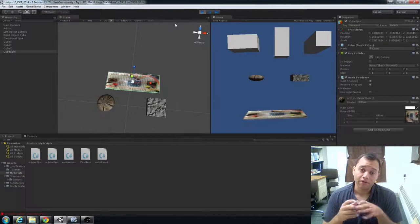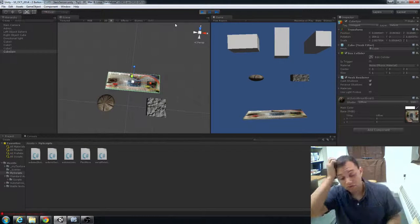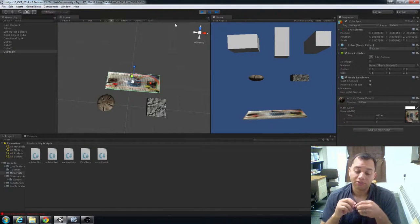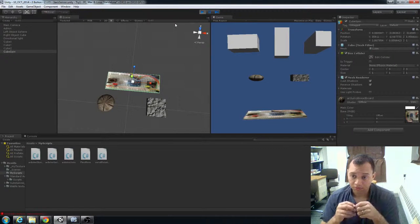and that's something I can measure fairly easily. The only issue with the potentiometer is it has a little bit of actual physical resistance, so you feel it on the glove, but maybe as you use it more that will wear down. And two, again, this is just proof of concept, so if it's not perfect, that's fine, because later on, if you want to go commercial, you could always get a lower resistance turning potentiometer, and smaller ones that would be more appropriate. So yeah, that's where we are right now.